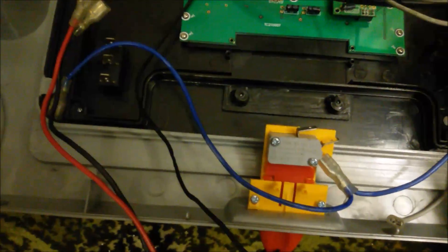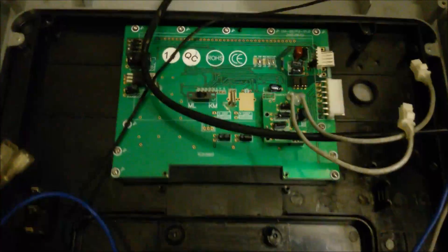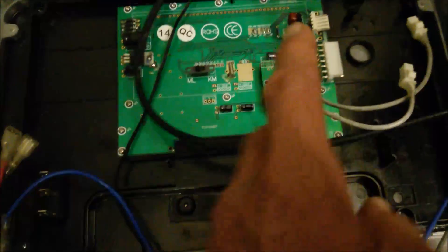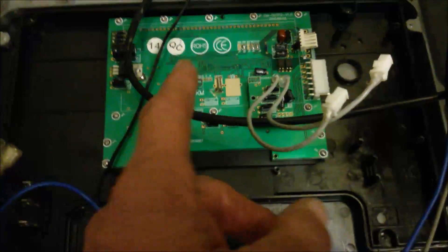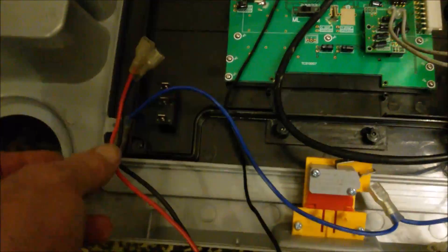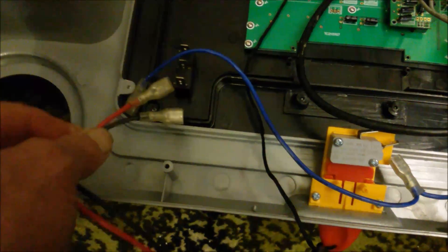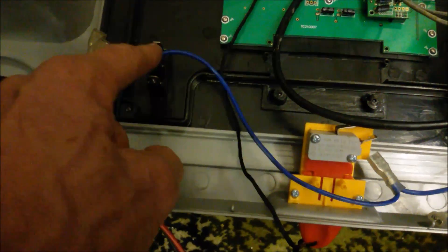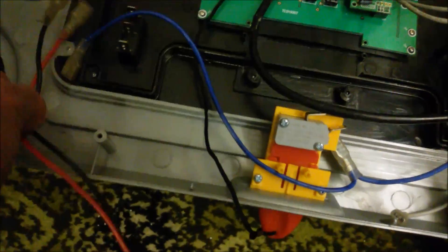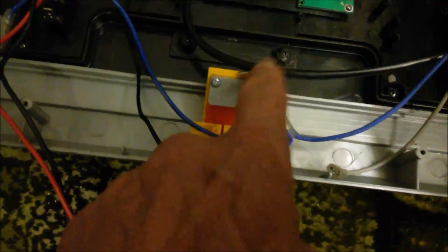The other thing up here is simply the control board. The control board has a multiway connector — those are from the pulse meter connector. So that's just the multiway connected to the control board and display up at the top. The main thing I wanted to remember was red and black switched from the live: when going up it goes to red, when going down it switches to black. And then the cutout switch — that's all there is up there.